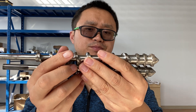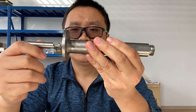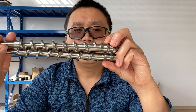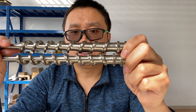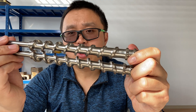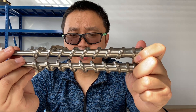The first reason is that this screw itself is manageable, but if you want to machine out a barrel for it — for a single screw the barrel is quite simple — when it comes to a twin screw, the barrel needs to be complicated, coupled with the twin screw. So for the price, the single screw barrel is cheaper, but for the twin screw, the barrel price is expensive — more than the twin screws themselves.